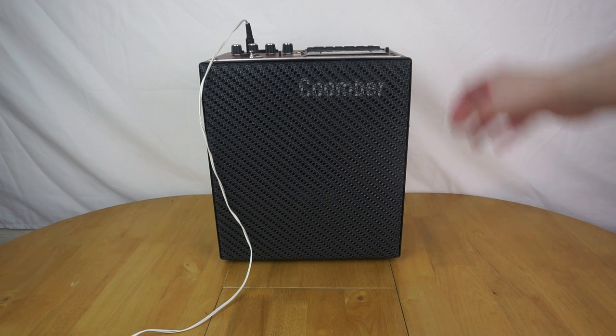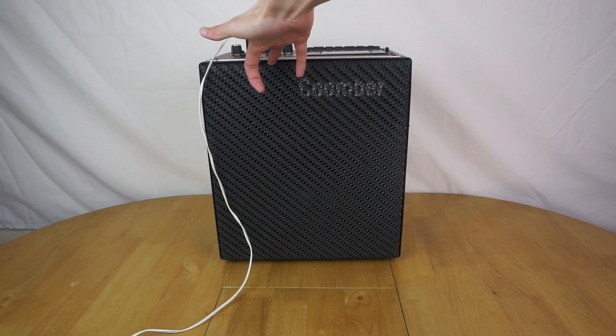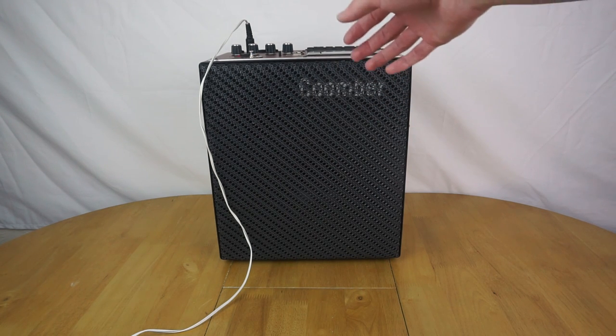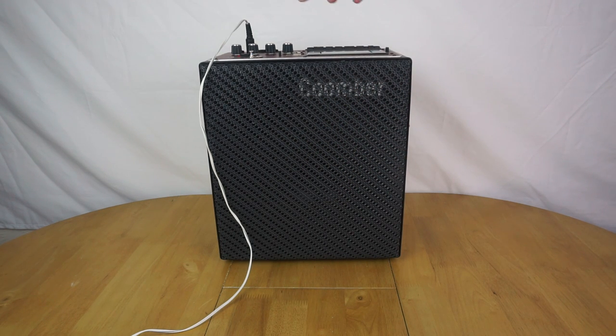So one thing I've found is when you're using the tweeter, you sort of need to turn the treble down a little bit and turn the bass up a little bit just to compensate, because I think the tweeter's slightly louder than everything else. But it sounds absolutely fine once you do that. And also beforehand, you had to tweak the treble and bass as well just to get it sounding quite right. So I'm going to play the same track and switch between the old speaker configuration and the new one, with the bass and treble controls optimised for each, so each configuration will be set to sound the best it possibly can. So we'll do that and you can hear how it sounds.